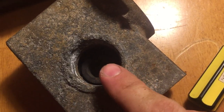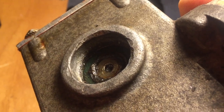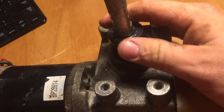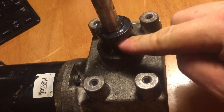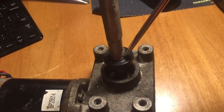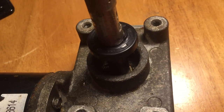You're going to pop this in. Now take your shaft and drive it down. This bearing up here is not going to touch yet — you're going to drive it through here, line your keys up, drive it into your bottom bearing. When it looks like this, it's nice and flush with the bottom — stop hitting your shaft, don't drive it any further. At that point, this top bearing is going to be raised up almost like the seal is here. The bearing is going to be sitting up here when your shaft is flush. You've got to take a piece of pipe and drop it down over here, or very carefully use a screwdriver, keep it out of the center, keep it on the shaft, and carefully work the screwdriver around it. Then drive that bearing all the way down until you can get your snap ring on it.